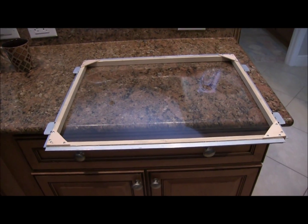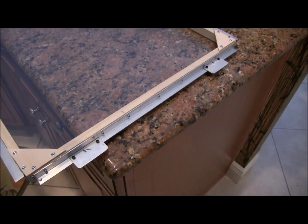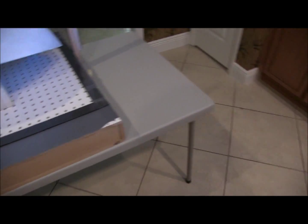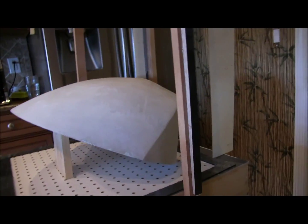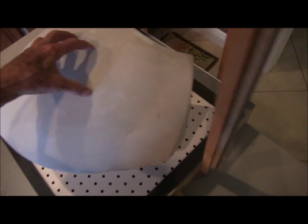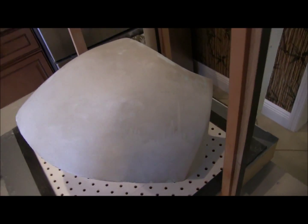Welcome back to the shop — well, in this case, the kitchen. I've made a few changes since our last attempts. I built a new frame, and you can see it's much beefier, heavier wood with angle iron reinforcements all around it. That should eliminate a lot of the problems we had with the bowing and the inability to get a good seal. I've also built a little larger box so I've got more room to work with — a vacuum former box. And the key thing I've done is I have elevated one end of the plug. This way I think I'll have a clear shot at getting the plastic on the top of the plug and pulling down around the sides. If it pulls underneath, that doesn't make any difference. But if I can get it pulled smoothly over this top now that it's all at this angle and then get down and get a seal, I think we should be able to get a good pull.